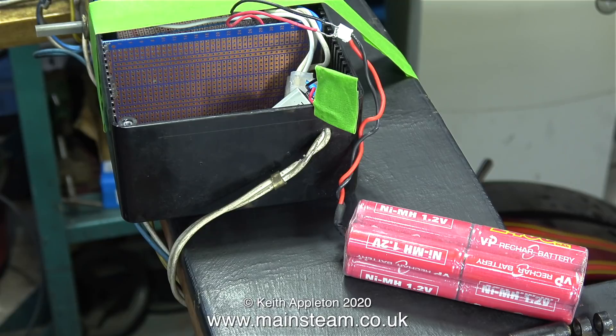The engine soon slowed down and I left it running. I wanted to have a quick look at what's inside this black box found under the canopy. It looks like this engine has an alternator rather than a dynamo. The original battery in the box was flat and the wire was broken, so I broke off the other wire, bared the ends, and pushed them into the connector of a radio control transmitter battery — this is 9.6 volts. With this battery connected into the circuit I got a flashing red LED on the box. I'm really not sure what's happening with this generator; I will figure it out in the fullness of time. It looks to me like the bulbs are all wired in series, pretty much like the old sets of Christmas tree lights — if one bulb goes then none of them work. And under the canopy where all the bulbs are, three of them are missing.